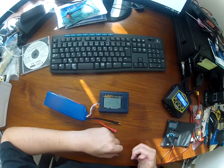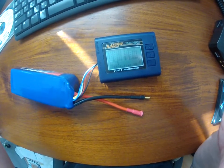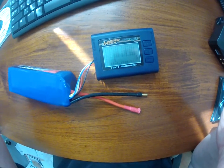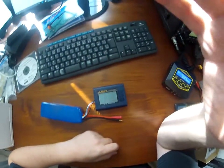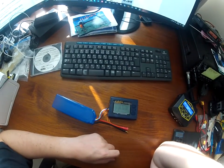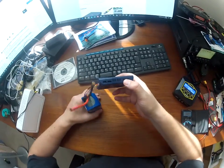The readings are: 1.317V, 1.42V, 1.35V, and 1.8V — the difference in voltage between the cells is huge. The total voltage indicated is 5.8 volts. I don't know what happened; I wasn't even transmitting on the radio, so there was no power surge. The battery just stopped working and its voltage dropped below usable levels. There's clearly a bulge on it now.